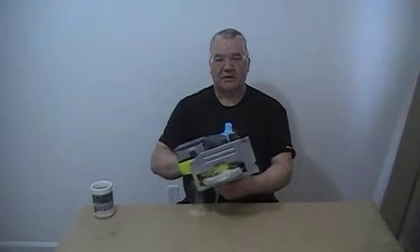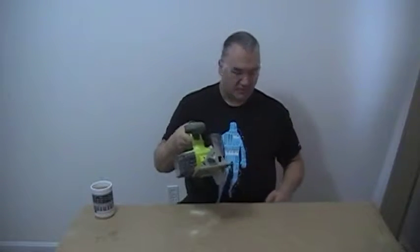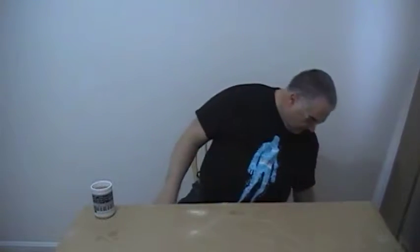Using battery-powered circular saws and other tools such as that, and things such as these reciprocating saws, you always have to be careful about how you're holding the material you're cutting. Make sure it's secure, because you don't want to slip and take a finger off or something. That would be very annoying. Same thing's true when using things like craft knives. These are obviously very sharp, designed to be, and you want to be very careful that you're cutting away from yourself, so if you slipped or something, you don't take the edge of your finger off.